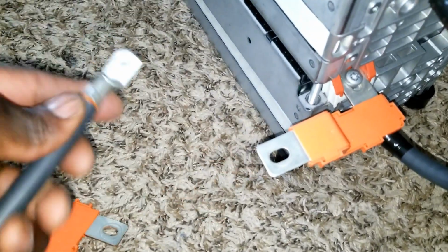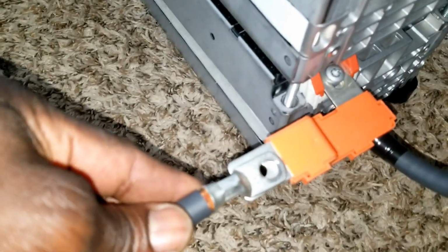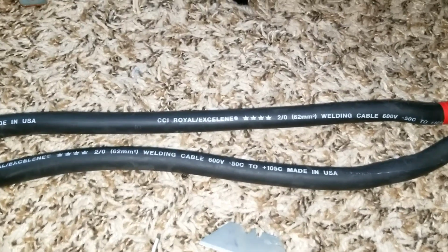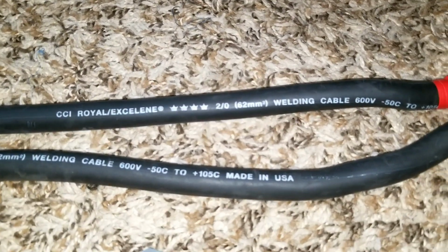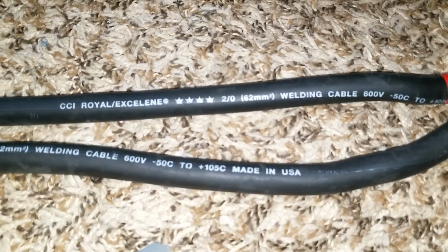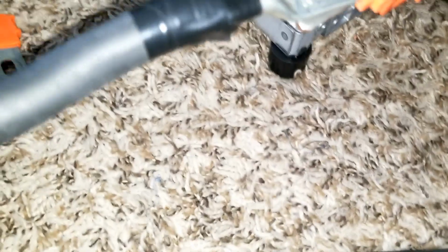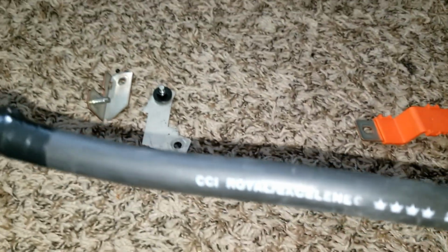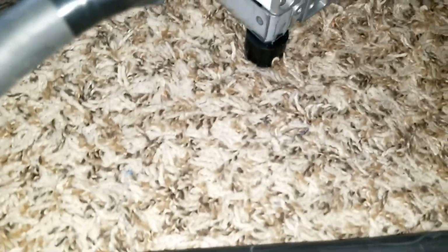I can take a heavy gauge wire now and go like this, heavy gauge wire, and connect. Okay, let me show you something quick. All right, this will be a good example. I can use a number 2 AWG 2 hot wire. You can see that, real excellent cable. So I can take this one and tie it up here with the bolt and nut, and this will go to the next battery bank, which is the other power wall.